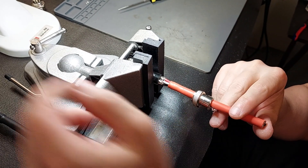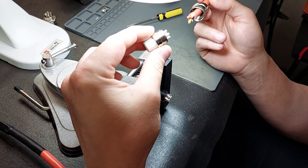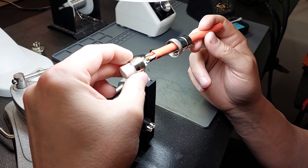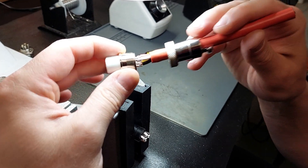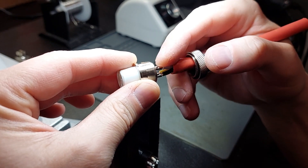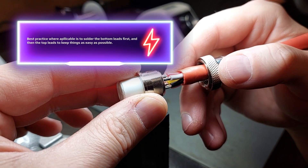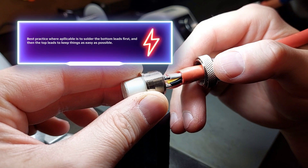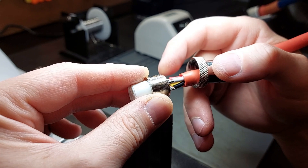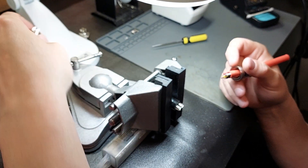There is no way around it. You either get the conductors in the proper position when working with cable or connectors like this H17, or you're going to have problems — especially if you've never soldered in an over-under format with your conductors. You can see the white lead here, black lead on the bottom, red lead here, and then you'd have your ground on the bottom. This is a very tricky way to solder because it's very easy to burn your casing or not get proper conduction because you don't have proper heat penetration with your solder and flux.